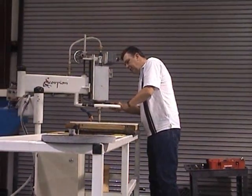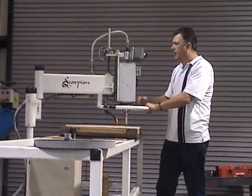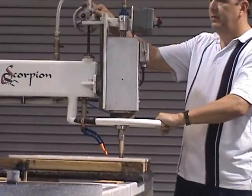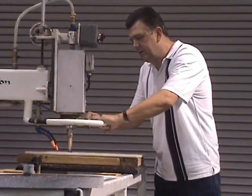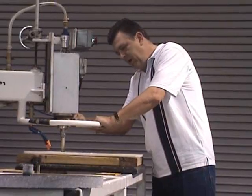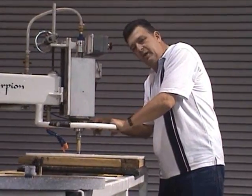The other secret of the machine is do not stop. As you're going around the template, give the hand wheel a half a turn and let it stay. Work your way around nice and slow and do not stop. If you stop, it drills a little hole and makes it rough the next time around.